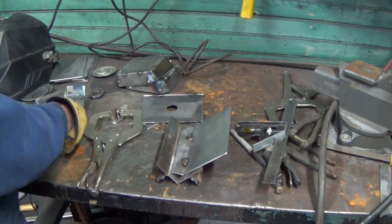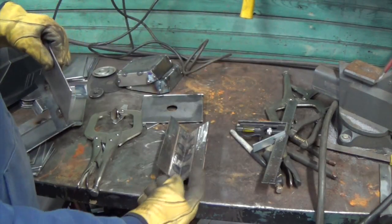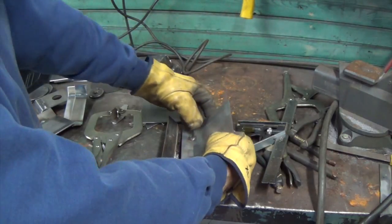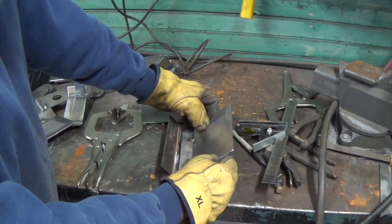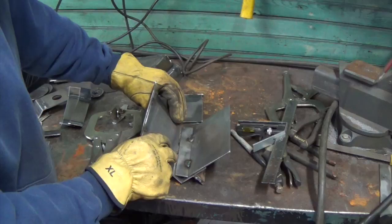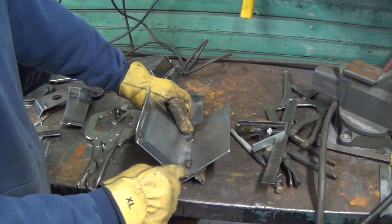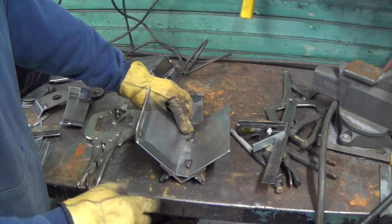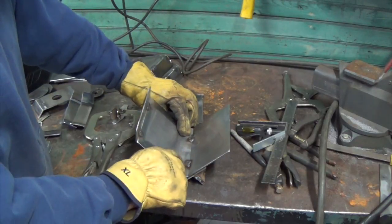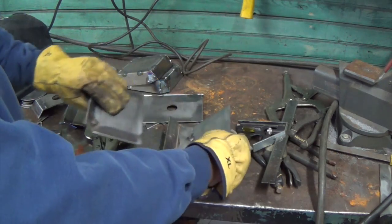because, I won't clamp it yet, as long as this long piece is 90, and this is 45, and it is, because we used a jig to do it, as long as this is flat against this side, and we slide this one in flat against that side, then this is 45. So that's it for the jig. The other 45 jig automatically makes it 45. It doesn't automatically make that outside corner the way I like it.